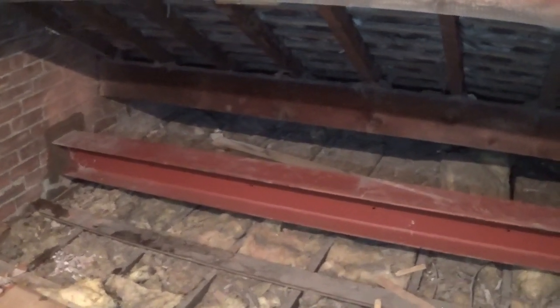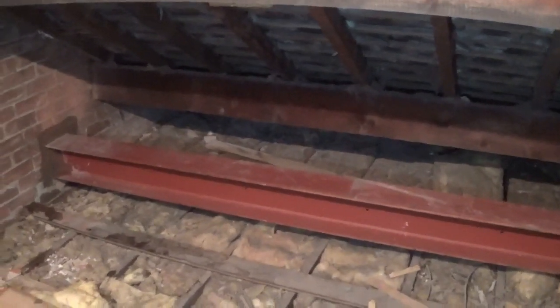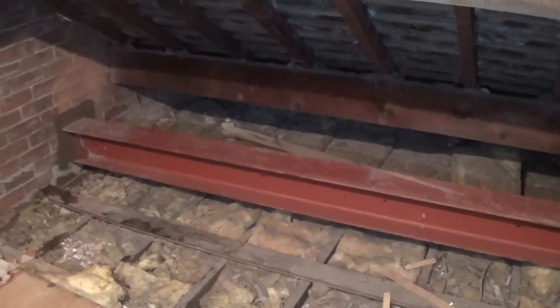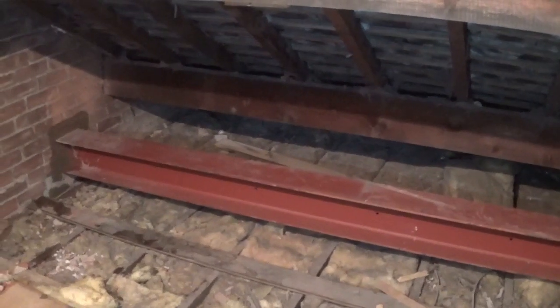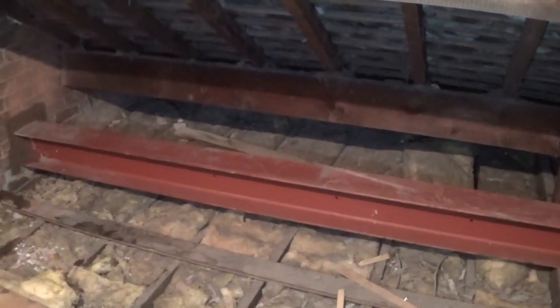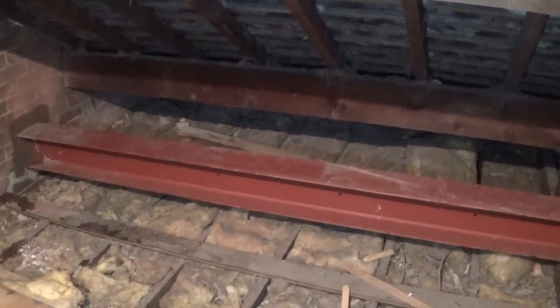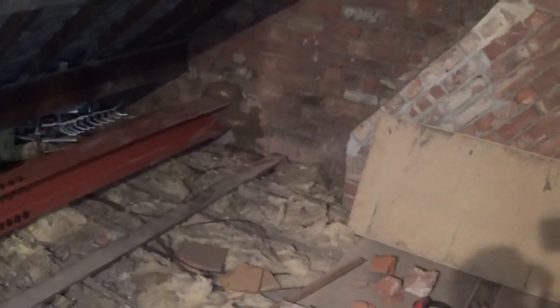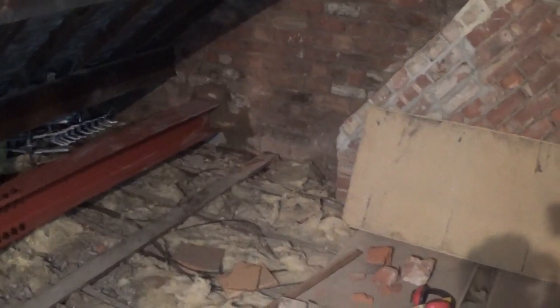I'm off Monday, Tuesday this week, so Monday I'll probably be taking delivery of the timber and sorting stuff out, but Tuesday hopefully I'll start getting a bit of timber up here, so I need to put the wood inside of the web of the joist. I then need to put the joist hangers onto that, which I've just got today from Screwfix, and then once I've done that I need to span my joists, which I think are 75 by 195 mil, so fairly big,